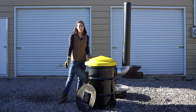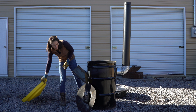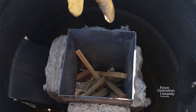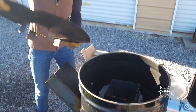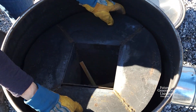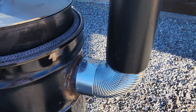I want to show you our rocket stove sap evaporator today — what it looks like and how we operate it. Inside the barrel is what we call the chimney, and that's got our firebox in it. Then we've got the flame spreader, and that's part of what makes it a rocket stove. The flames actually come out of here and then go back down into the exhaust, so we get a re-burn that way.